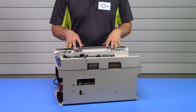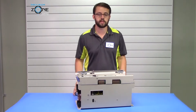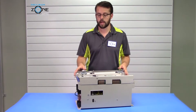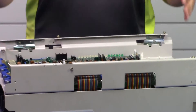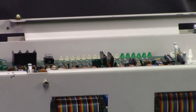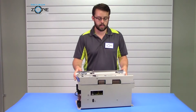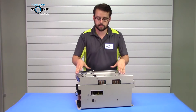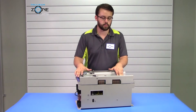Lastly, the alarms you could also be getting are the DEV or the OS, which are speed deviation and an over-speed alarm. Those could be caused by incorrect feedback from the spindle motor to the drive. It could also be a connection issue between the feedback and motor, or a connection issue between the motor and the drive itself. It could also indicate that there's a problem with the drive settings and it would need some proper tuning.